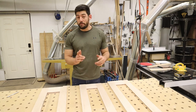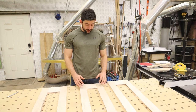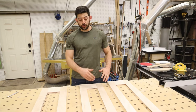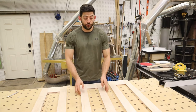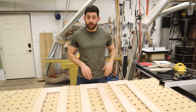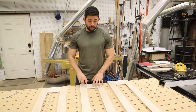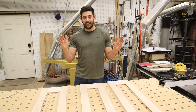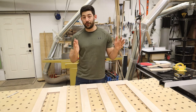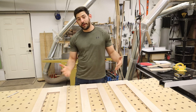Interestingly, my original geometry may have been right, because once I cut the tongue and groove for the shaker panels, the piece I cut shorter for the dry fit is now too short. The good news is I left myself plenty of extra width, so I'll glue them up aligning the angled cut at the top, then measure the shortest piece and cut the other two to match. The angle brings the tenon an equal distance that's actually different than the distance at the bottom, changing how it laid out in dry fit versus with the tenons cut. So leave your shaker door pieces a little bigger than you need when cutting with weird angles.